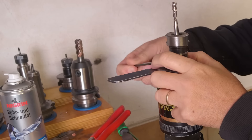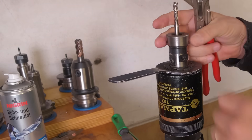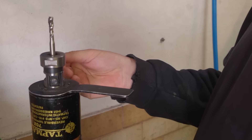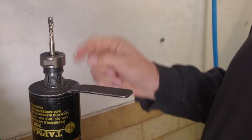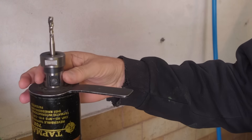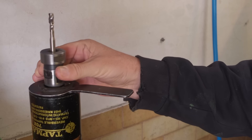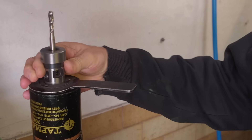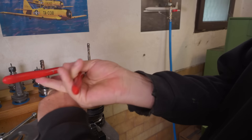I hope this one doesn't follow its mate straight away. I think what I'll do is tap this not quite as deep — at least that'll give me a nice straight starting hole and then I can still hand tap it with a bit more feel afterwards. I look back at the toolpath I used the first time and I only had it feeding at 70 millimeters per minute. That shouldn't have mattered — if the infeed is slower than the pitch rate it should have just pulled itself out, disconnected, waited for the spindle to catch up, tapped a bit more, disconnected. That shouldn't have caused a breakage. I suspect it was a blunt tap or something.